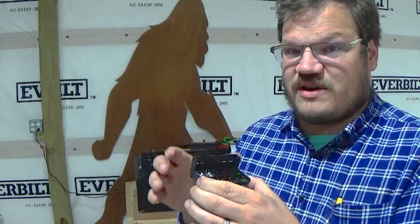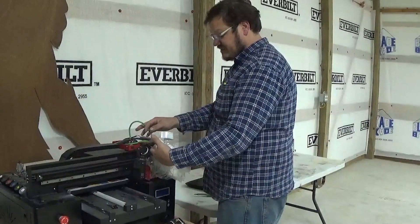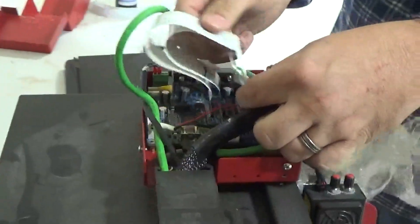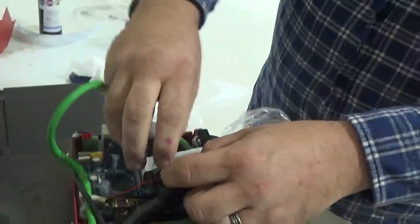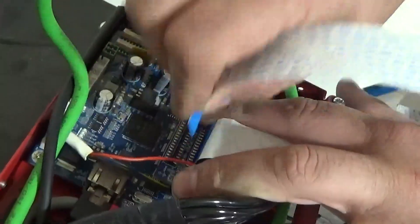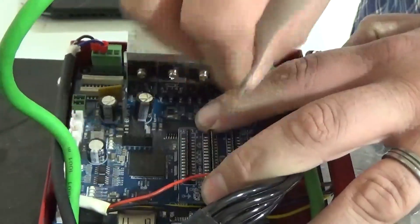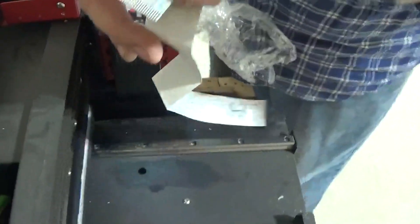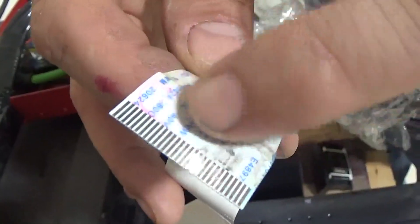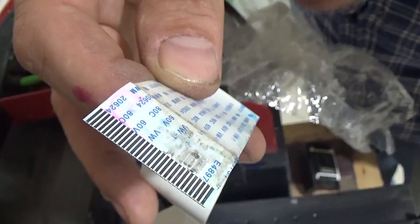When we go in here and look at this board, you'll be able to see why that's important. I suggest that we replace these wires, so we need to snake up in here and take both these wires out. We'll disconnect this — just take two fingers, pull the board down, wiggle them out. You can see the ink sometimes gets down into these. The ink gets down in here and these will delaminate and they need to be replaced frequently.